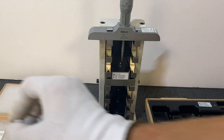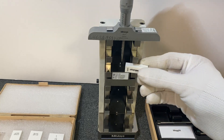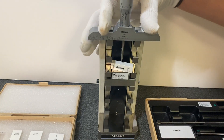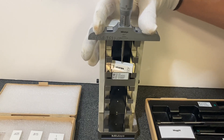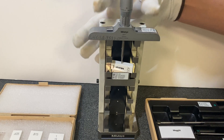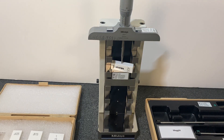This particular unit didn't need it, but I'll show it on the next one. I'm going to keep retracting. Here's the 420 gauge block. And if needed, I'll kind of support this so it doesn't pop up as I begin to index this ratchet down. Just a gentle pressure to hold it in place is useful. There's the next reading — good.